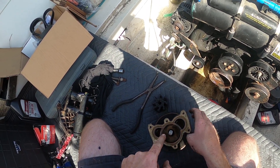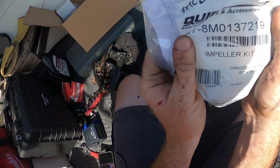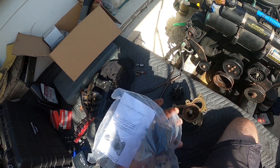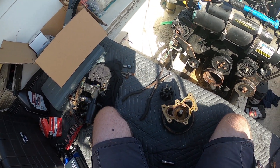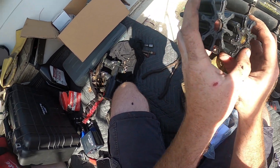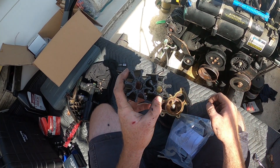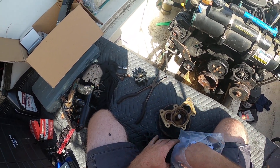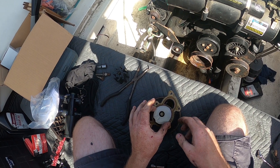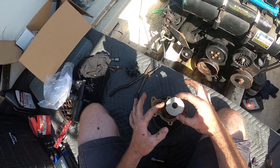There's our impeller — there's also a lot of wear in the bottom. We can fix the wear in the bottom. This is a special Mercury impeller kit, part number 8M0137219 — it's called a heavy-duty impeller kit. Note the difference: impeller hubs come in different colors. This one's white and this one's red. The red one can only be used with a wear plate. You cannot put a white one where a red one goes — you will actually burn the impeller out.